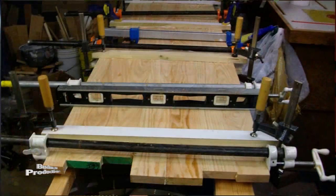After doing the SketchUp, I went out in the shop and got to work. I didn't want to build the shelf itself out of stock three-quarter inch lumber. I wanted it a little thicker simply because of the weight and I didn't want to end up with any sags eventually. So what I did was I milled some raw oak lumber down to seven-eighths of an inch. I did the glue up.